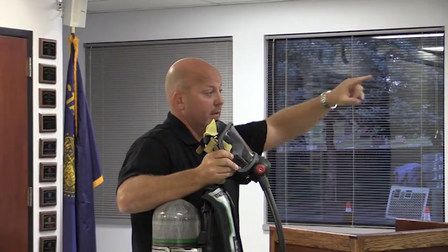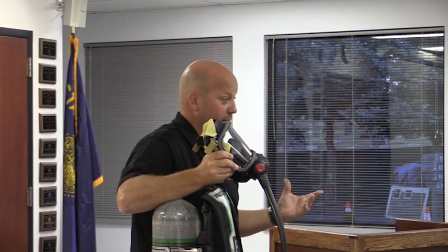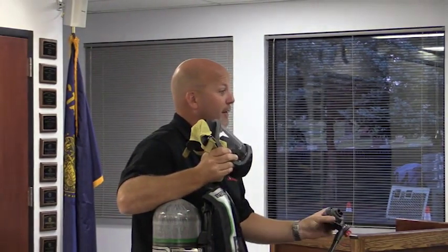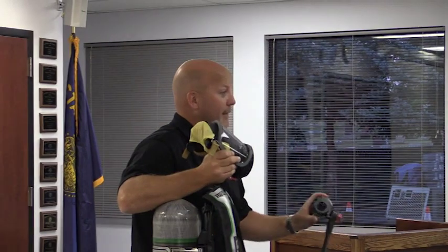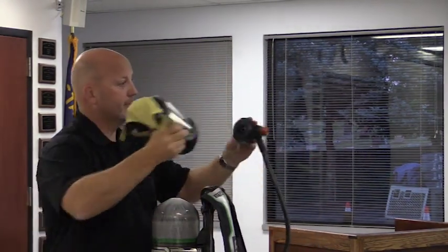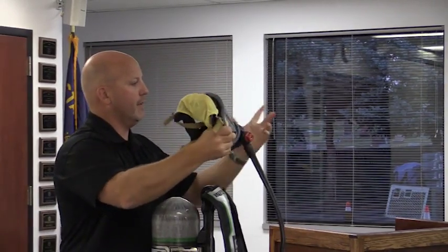Exact same scenario that you have on your current SCBAs. The difference is it's the top button. Nobody's even probably noticed that was a shutoff switch, if you follow me. You just know when you take the mask off, all of a sudden the regulator doesn't have air coming out of it. The top button is your air shutoff. Bottom is on this one. Make sense? Okay, so that's your connection of your regulator to your SCBA mask.